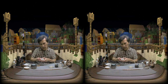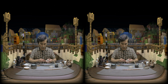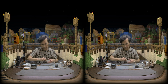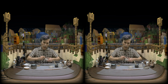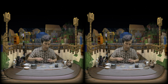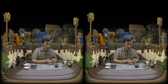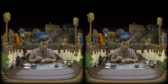Now I'm not too overly concerned about the exterior finishing, because I actually remove the PLA when I'm finished, and I suppose you can call this a lossless casting method. But anyway, you want to attach the wire to your part first. Sometimes you will need to seal it with a little bit of crazy glue on the side, just a little dab, just to hold it, especially on larger structural pieces. So we take a little bit of this.